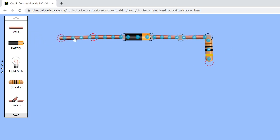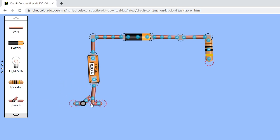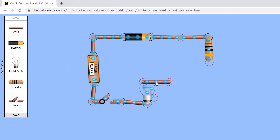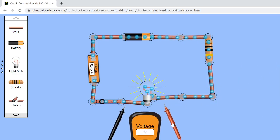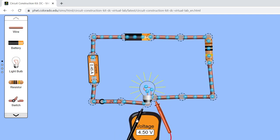We also need an ammeter, and we also need a switch. Using this, we're going to have an X wire here. We're going to put our bulb connection there. We're going to connect it again, and we're just putting all these wires so it looks a little bit neat. That's our connection. Close our switch. Our current is flowing. We'll need to set our voltmeter in parallel, and I'm going to connect it right here for neatness.